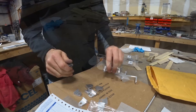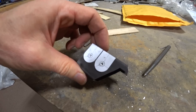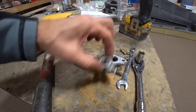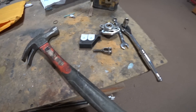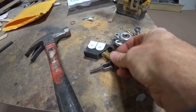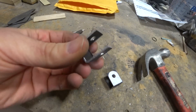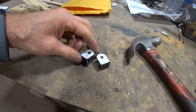I got all those cleaned up using the countersink tool. The next job is to create a couple of similar brackets for the side sticks, to connect them to the elevator torque tube, because those other forks I had were a little too narrow and too long. So I decided to create my own — it needs to fit a rod end in there. As you can see I've got those cut out; I just need to round off the corners and drill the holes in the backside so they can mount up to the spindles and then assemble everything.